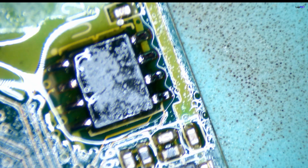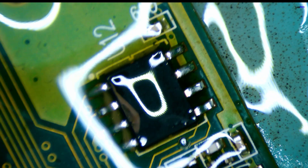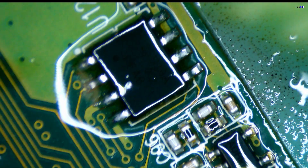Now we're going to put the chip back, using flux again with hot air. You just need to be really careful because you don't want to put too much heat, otherwise it will damage it. Looks to be solid. We're just going to clean up — put some alcohol on it to clean up the flux. We don't want any flux left there, and that should be really good.